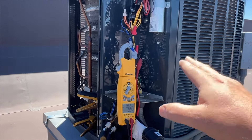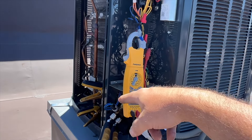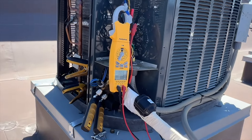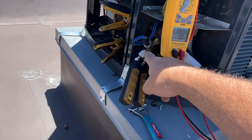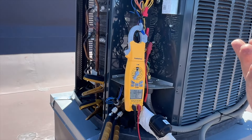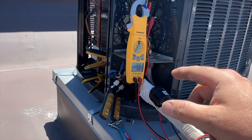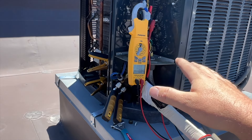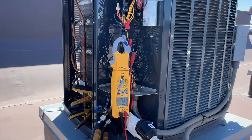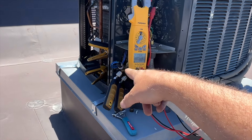Trane has their own proprietary low ambient controller — it has an ambient temperature sensor and a coil sensor. That one went bad and I recommended replacing it but never heard back. So now we have this cheap peanut replacement instead. The peanut is set to cut in at 400 psi, and the high pressure switch is set for 450 psi. So it just barely passes cut-in and then trips the high pressure switch, causing it to short cycle — not good for the compressor. I think we need to go with something with a lower cut-in pressure.